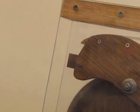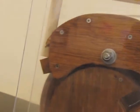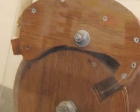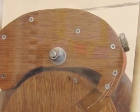To lock it, we simply put the bolt back down into the hole, push down on it, and on a good lock, one of these wheels would actually turn slightly to keep this lever from turning again, and that would start the whole process all over. Now it's locked, and we need to go through all three numbers of the combination to get it to open.